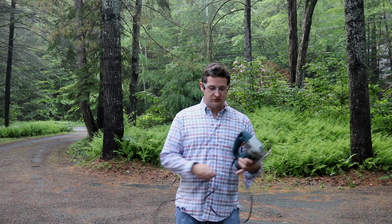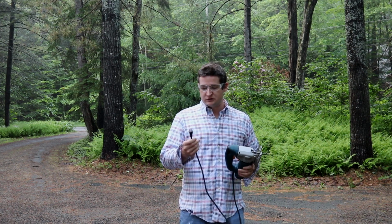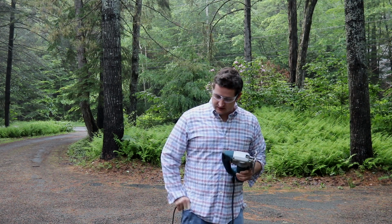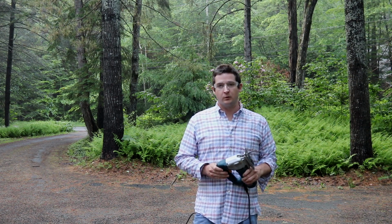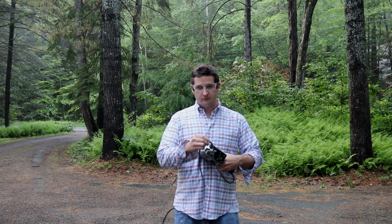And one thing I like to do, just to make sure I have complete control of the tool when I'm changing blades or working on it, is to take the plug and stick it in your pocket when changing the blade. That way no one else can inadvertently plug it in while you're working on it. And the final tip of the saw, don't cut your cord.